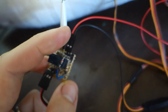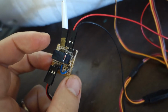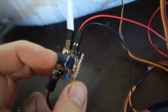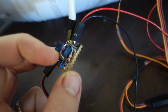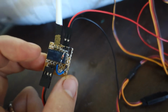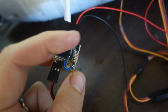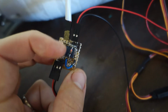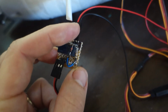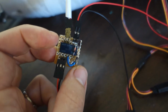So the trick I mentioned is that the connection from the RCCC board can go floating. It's either ground or floating. When it's floating, you cannot control relays with that, right? So the resistor is actually meant to send 5 volts via pull-up, and if nothing is happening here, if it's floating, then the 5 volts will show up. Otherwise, this will bring ground, and it will override the resistor and energize the relay the other direction.